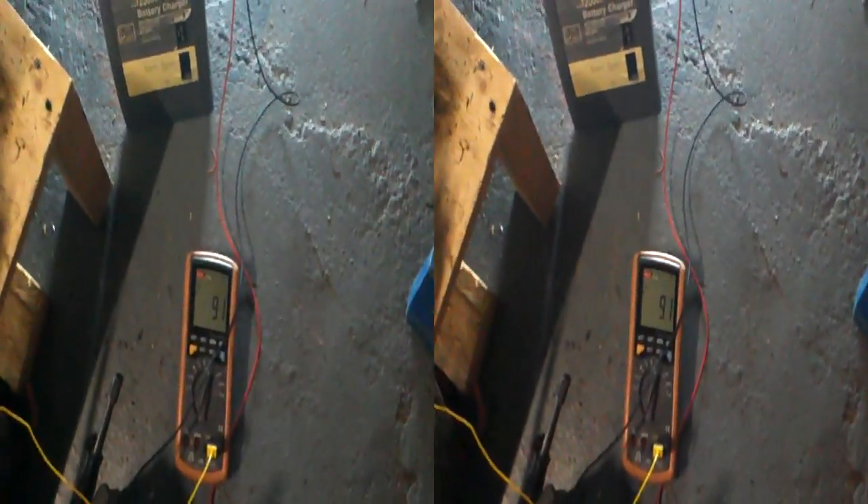I'm going to cool it down — I don't want it to go up to 90, so we'll stop it there. It's actually 90. So there's a bit of a miscalculation — what it is, is that the sensor I've got is kind of embedded into the claw, which makes it easier, but there's an insulating bit between there and the claw, so that's caused it to sometimes get a bit of a wrong calculation.